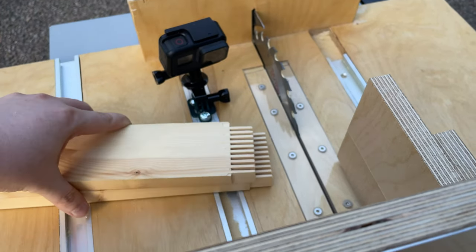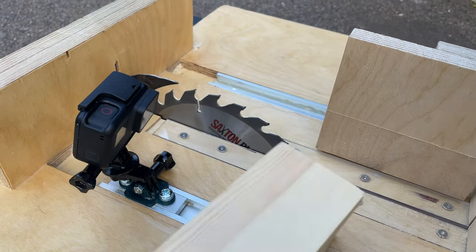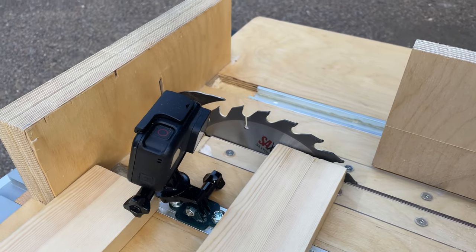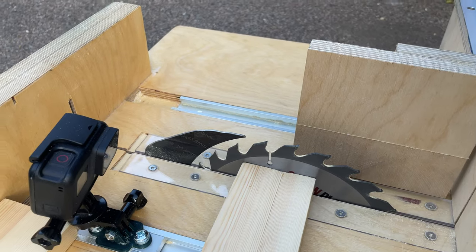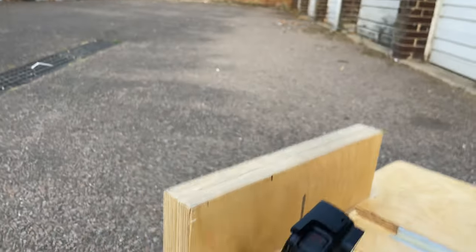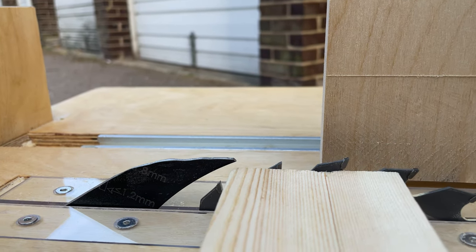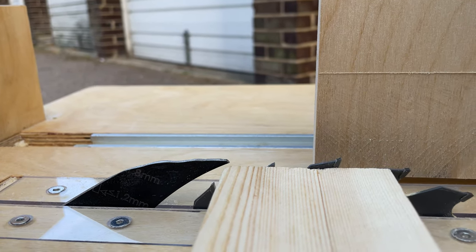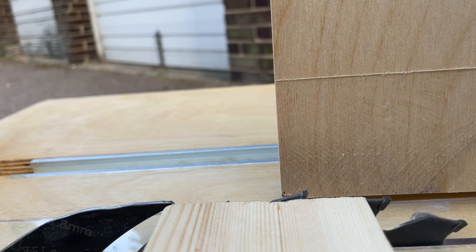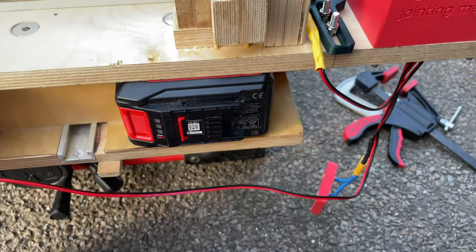Simple enough to do if you have the right tools. I'm going to set the depth of cuts correctly, so I simply put my piece of wood next to the highest point of the blade. We've got a crank to raise and lower the blade, and I lower it down until it's just a bit beyond. You don't want to go for exactly because nothing ever works out exactly — the fingers will stick out a little proud and they can be trimmed off afterwards.